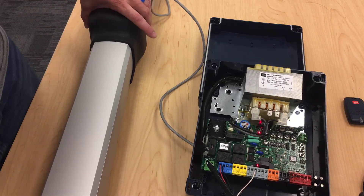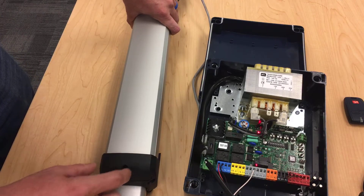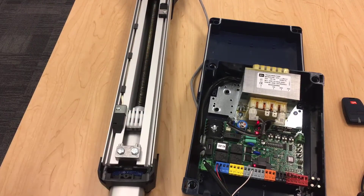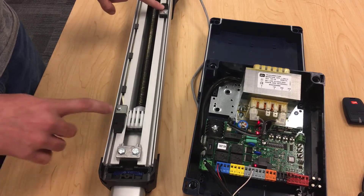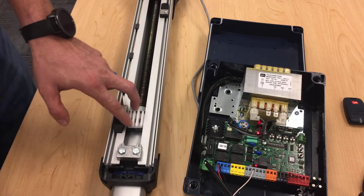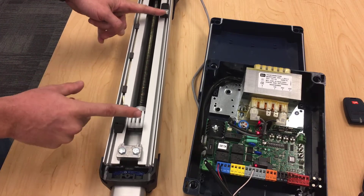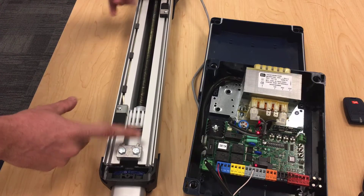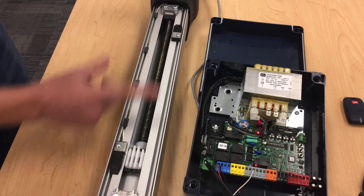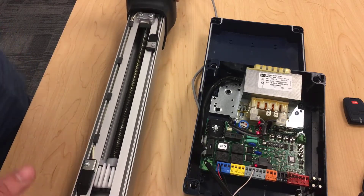Make sure that your limit switches are done correctly. Use a Phillips head screwdriver to take out the screw, slide the piece off, and the cover comes right out so your limit switches are exposed. These are your limit switches and this is your magnet. Before you get started, make sure that your magnet is lined up with one of the limits or in between the limits. Sometimes when packaged, the magnet is a little further out and it doesn't do its thing — it can get stuck. So make sure your magnet's in the middle before you start programming.